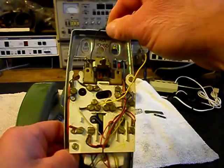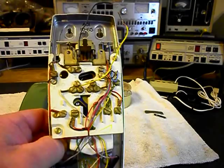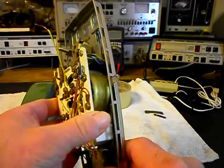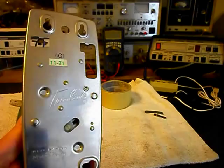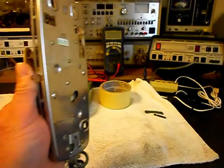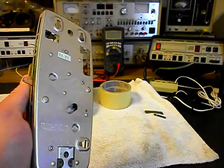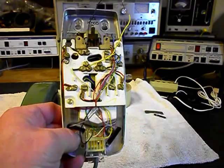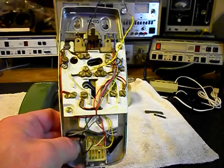This telephone has some wires hanging off the network, but we need to install a modular port so that Gary can simply walk up to this telephone after he's mounted it on the wall and plug right into the modular port with any line cord, any length, any color — makes for a simple plug-and-play connection. As you can see, there's no way to connect this telephone to the wall currently. Usually these telephones hung on a wall jack — you'd put them on and slide them down. This one is mounted directly to the wall, so that's why we're installing a modular port.